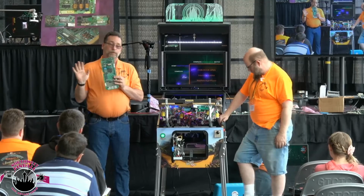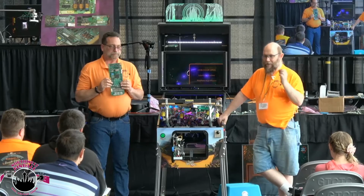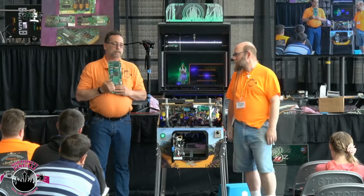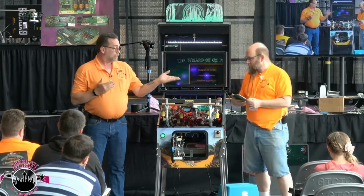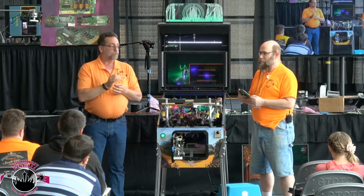If you do want to tackle it, you need to know which end of the soldering iron to hold. You need to have fine control with clippers. You definitely want to cut the chip out, cut the legs, and then individually desolder the legs. I'm a tool whore. I love tools. I have three different desoldering guns, and each one is cool in its own way. Generally, when I put a desoldering gun on one of these, it'll eat a trace. I would actually prefer to use desoldering braid after I've individually removed the legs. I'm going to heat up and individually remove each leg after I've cut the chip out.